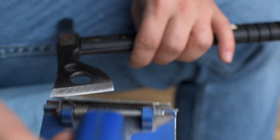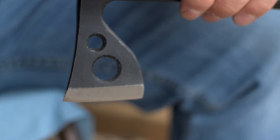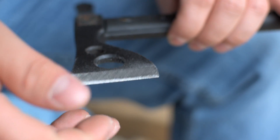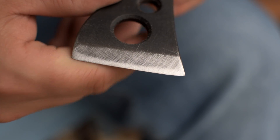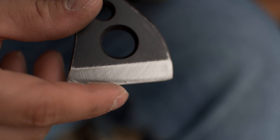Your strokes want to be not perpendicular — you don't want to be pulling directly away from the edge. You want to be pulling out and across the edge. Notice how my scratch pattern is on that diagonal. And as I refine my edge, I'm going to pull even more with the lie of the edge — come more across the edge — and that'll help counteract a big burr and take that burr off while you're sharpening. Here is that scratch pattern off the 60 grit paper. I did a couple final strokes back into the edge very lightly, which is why you see the couple scratches going the other way — that is just to remove a little bit of extra burr.